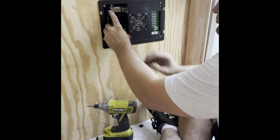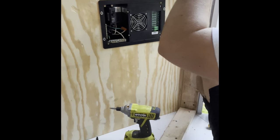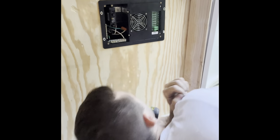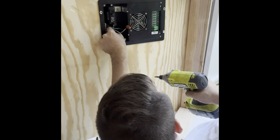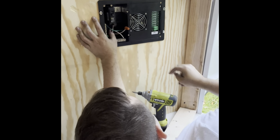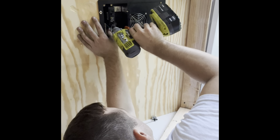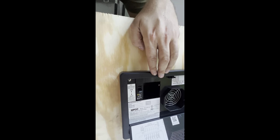I'm connecting it in, and on the back there's a little space where you can just pop that breaker in on that bar. Once you have power on that bar, it provides power all the way down the metal bar — you can see it to the right of the breaker. That's what gives the other breakers power, so if the main breaker is off, the others don't work. I'm going to put two more breakers in to run outlets.